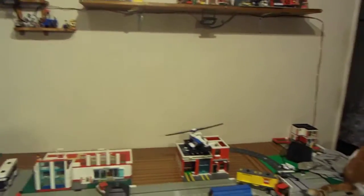At least I know the earths are also working because it tripped out. I'm happy that I know the electrics are safe in that sense - if anything goes wrong they are going to trip. Thankfully it was just a tiny pinhole and I only found it because I was putting the cable back into place. I found this tiny little black pinhole on the cable, and when I looked up on the inside of the fluorescent light's case I could see a scorch mark as well, which gave it away.